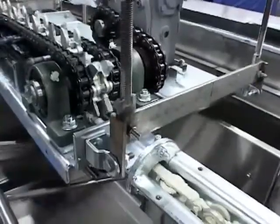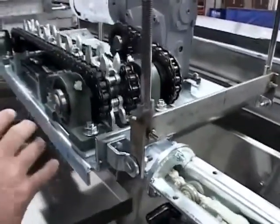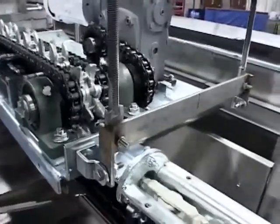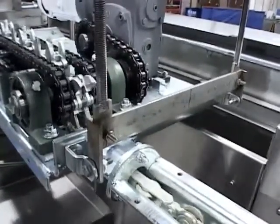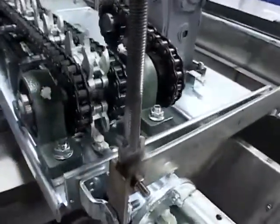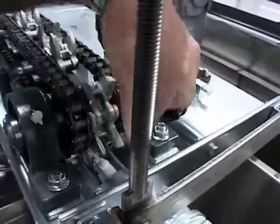As the chain's going through, the drive system is made up of a series of dogs. The dogs will open up on the top side, and as it's connecting to the chain, it must connect on the horizontal wheel, okay? If it connects on the vertical wheel, probably we will shear off the pins and you will break the chain. So as it's coming through here, it has to connect on the flat wheel. So it'll come up, it'll close and connect on the flat wheel.